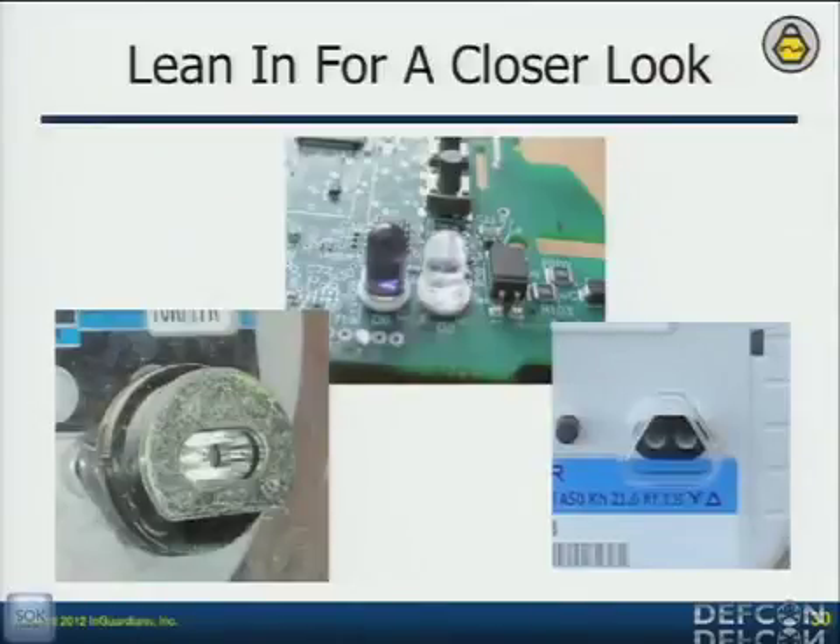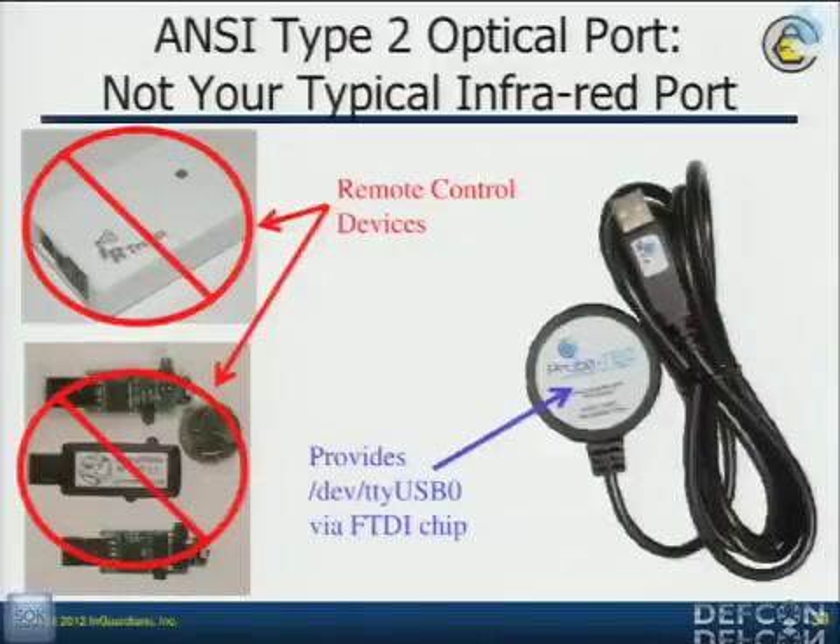In order to communicate with the optical port, I have to understand what it's made of — it's just IR LEDs, developed according to a standard. I was in a time crunch, so I spent $350 on a commercial optical probe. I plugged it in and I've got TTY USB0 — USB to serial. My FTDI chip that I'd been using for my hardware client was the same thing, so I'm one step closer and don't have to modify much more. I also contacted GuanaWorks, who make an IR dongle. We helped fund some of this research, and they were able to get an initial production unit. Not only does it have USB, but we also made a version with serial out, so now I can plug in things like an XBee module or a cellular modem to make wireless optical probes. This will probably run between $50 and $75.